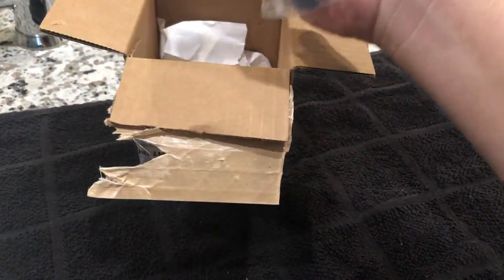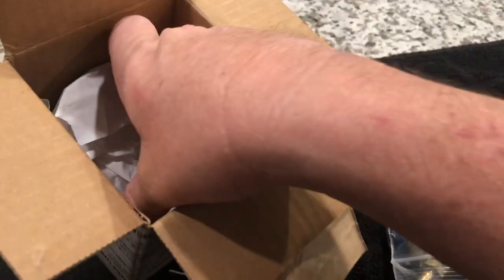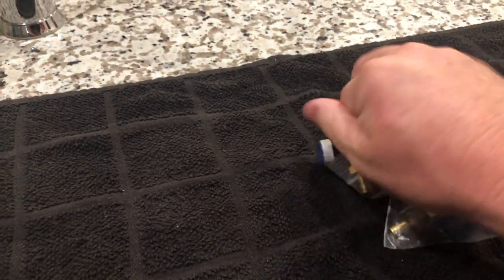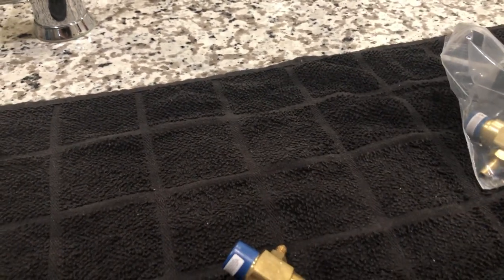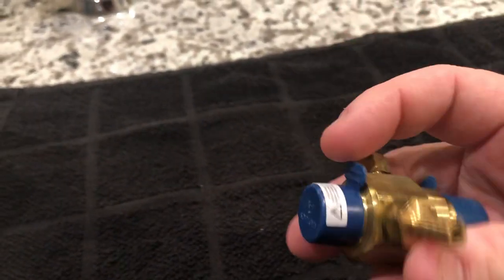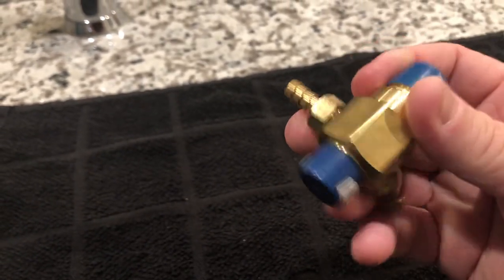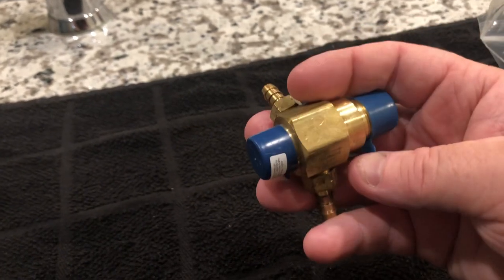The second part of downstream would be to use one of these — this is something new. Well, it's been out a little bit; it's kind of new to me. I hadn't really paid much attention to it. This is a downstream injector, and its capability is to throw 30% — probably on a 100-foot hose with something like a 0.080 orifice or so. So this is what we call a dual barb downstream injector. It's without the quick connects, and it's got the little protective caps on it for the threads. You're going to put your quick connects on this, or if you're hard plumbing in — which I don't recommend — just put your stainless quick connects on it.